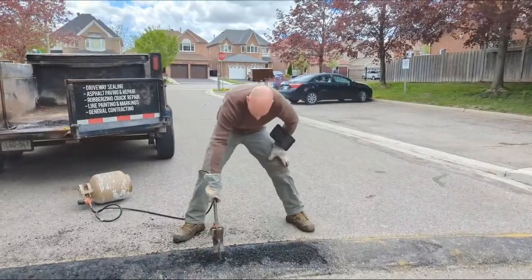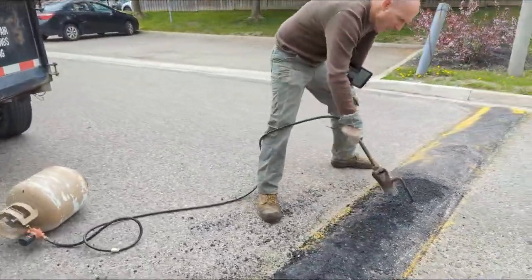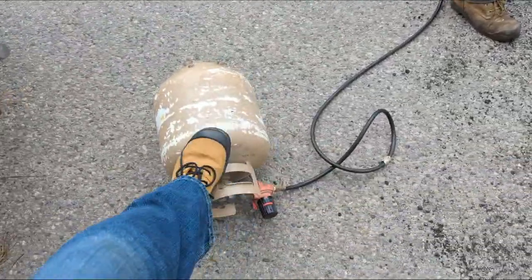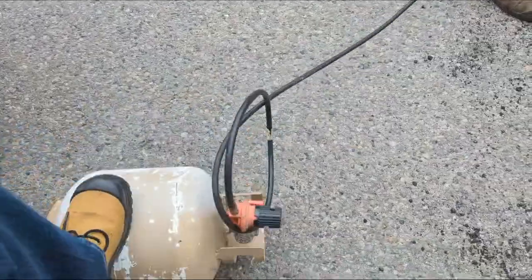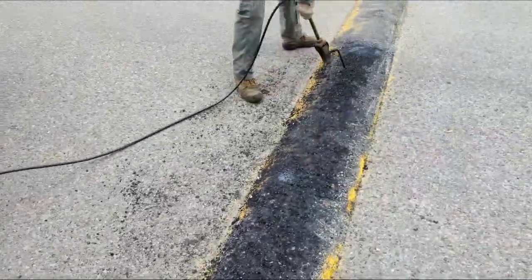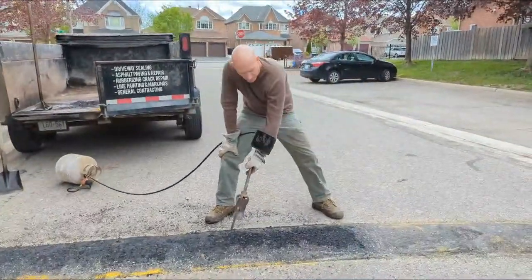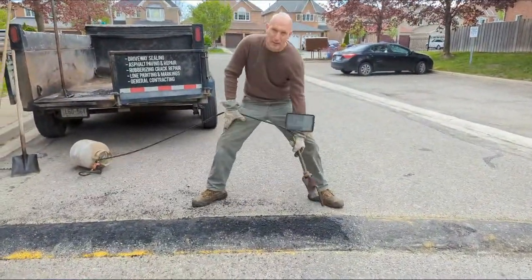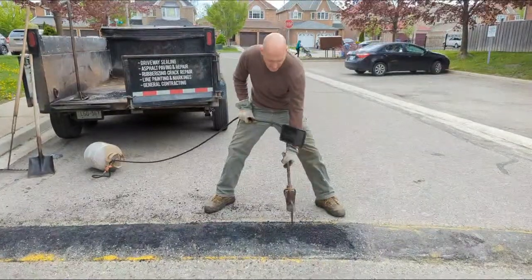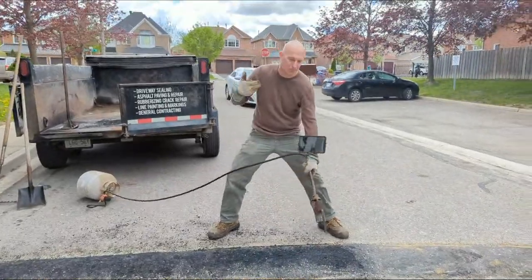A propane tank can last a couple of hours, but you can hear the one that he's using is getting a little bit weak. We're almost done, so it doesn't matter now. But if I take this propane tank and just roll it the other way, you're gonna hear the thing get a little bit louder. Propane is always evaporating, so this is burning the gas. But when you fill up propane, they're filling up liquid. So you're either burning liquid propane or vapor. So this is vapor. If you use more vapor than what it's making, you have to wait for the propane to boil over.